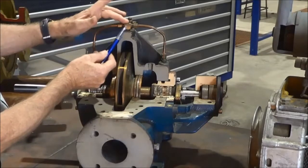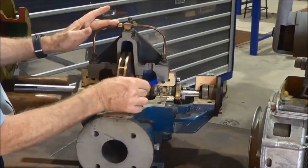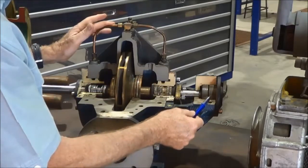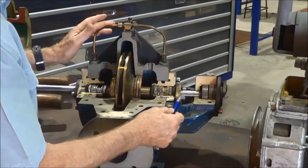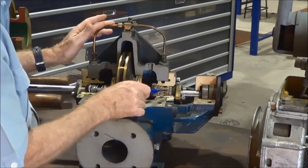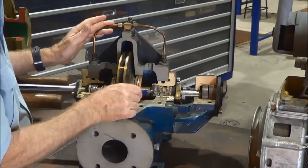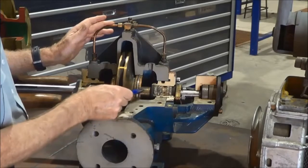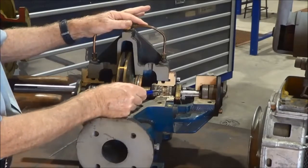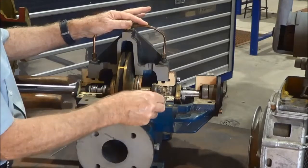As you can see, from the casing we're piped out and down into where the gland is. Those are the bearings there supporting the shaft. We've got the gland with the adjusting nuts on it, we've got the stuffing box, and then we've got two rounds of packing, three rounds of packing close to the impeller, and then we have the brass ring there in the middle — that's the lantern ring.